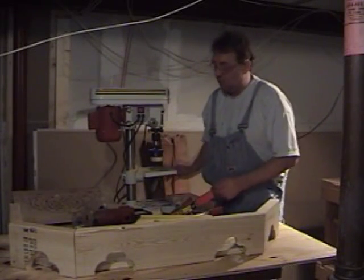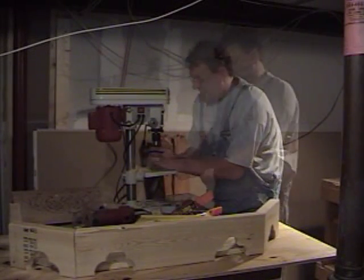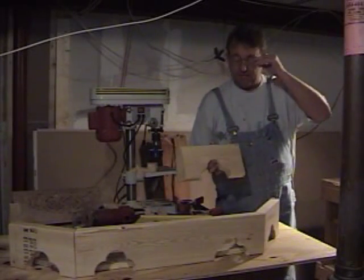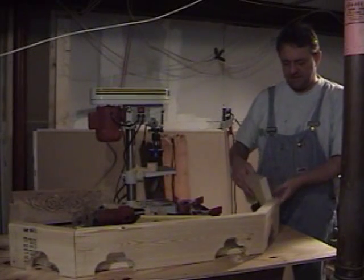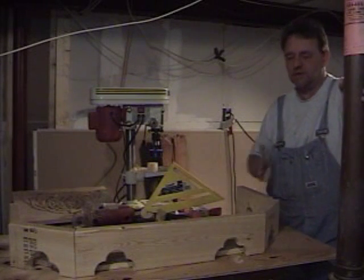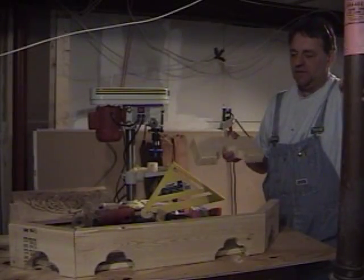It's a good idea to clamp the work down because you'd hate to end up ruining your piece before you even get a chance to put it together - there was a knot in that, and that's why it kicked. So we get a nice little gothic shape, or Celtic, whatever you want to call it. I centered it on each piece. The pieces on the bottom are cut at 22 and a half degrees instead of just 45, so it has an octagonal feel. This is the base cabinet - we'll glue all of these together, put our base board on, and then start to build up.